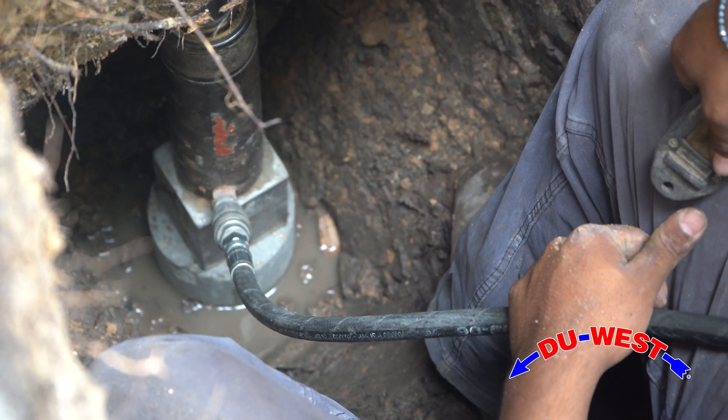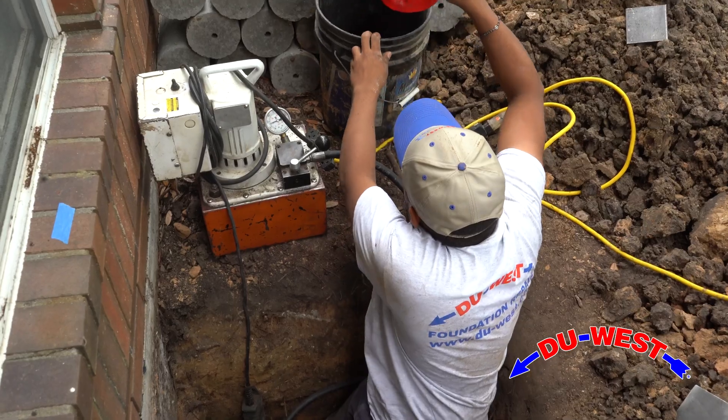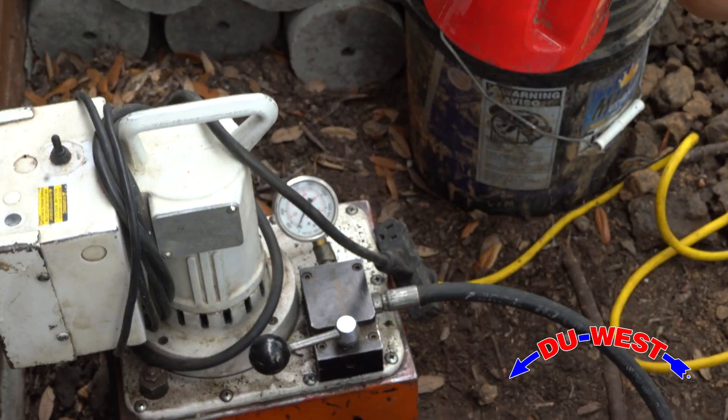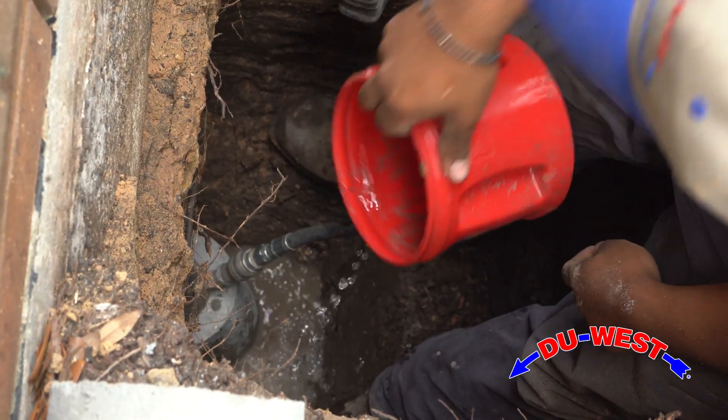Without that added depth driving, you're just not going to fit the next cylinder on top. That water is critical: as the soil is being softened and the pile is being driven, it's going to pull the water down into the hole. You've got to continuously be adding water to keep it moist.